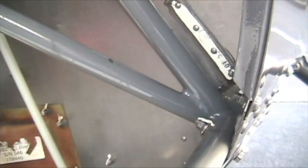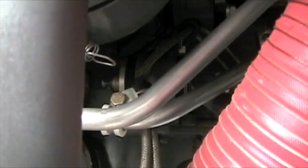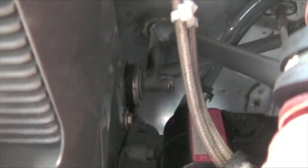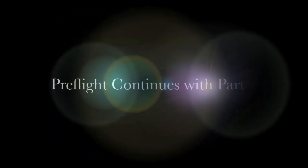Follow this all the way around. On the inside it goes up and attaches to your engine — there's one of your engine mounts. Go up here more, see it goes up through the firewall, the platform on top — another engine mount. This frame goes everywhere, so don't just glance in here. You can do a pre-flight without really doing a pre-flight — you can look at something yet not really look at it. Notice it's nice and tight, it's not going anywhere.